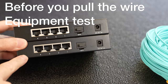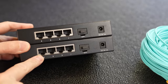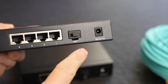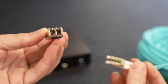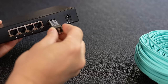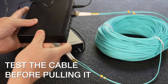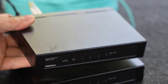This is the least expensive way to do this. I've got one switch for the workshop and one for the house. These ports are going to be for things like computers, routers, even access points — but I need to connect them together. What makes these switches so unusual is this SFP port. This little device is called an SFP module, and you can see that these plugs go into this to give us our fiber uplink port. I clicked in the top one — the SFP light came on — so this cable is good.